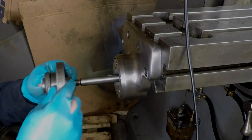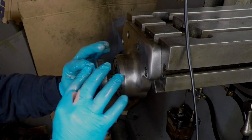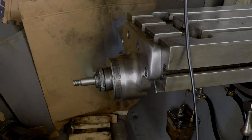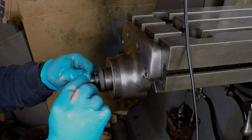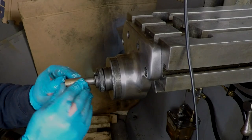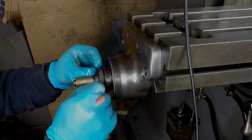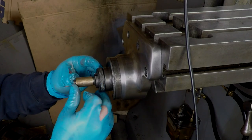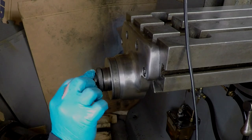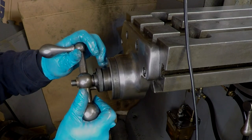Now I can go ahead and put on the dial and the dial lock. This washer is going on in the wrong order — the first thing that needs to go on is a bronze bushing, over which a spring is placed. Then the washer should have gone on before the handle and the nut. Once the handle is secure, the table is finished minus the power feed.